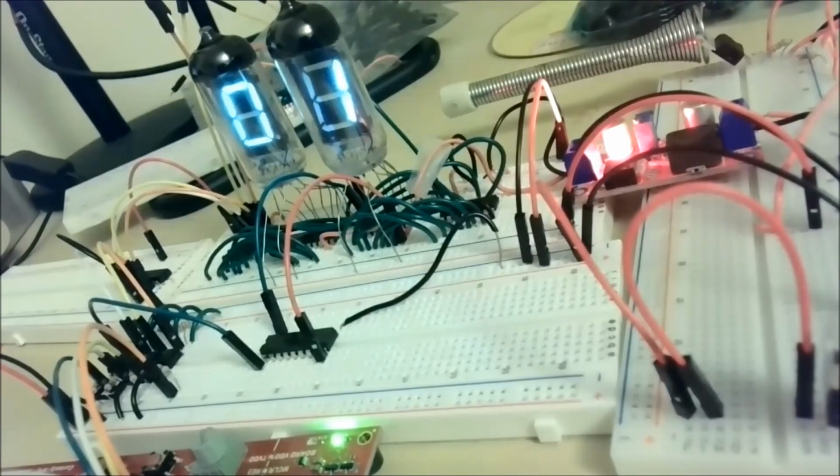So yeah, the power supplies. I'm going to use modules for all the power supplies because those linear regulators are just not very efficient at all. It was kind of interesting because back in the 70s, when they were designing big boards with 7400 series logic, if you look at stuff like the original Apple computer, they were probably using 7400 series logic. They had the integrated processors, but they had a lot of logic chips in there too. So definitely very inefficient stuff.